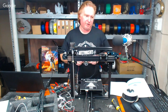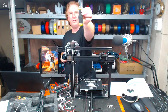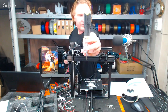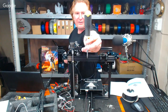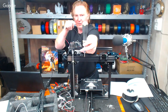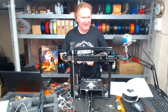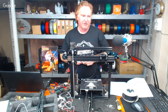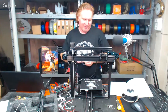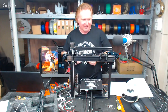Well, I understand the need for a purge block. Because if you're going to have a crisp color change, here's a better example. Let's say you're taking this handle and printing it like that on your build plate. To transfer from the yellow to the black, if you just had it do the transfer, you would have a certain amount of yellow mixed in with it, and then it would slowly transfer into the black. Unless a person was able to somehow have it do its purge in the infill portion. Now that might be a possibility too in the future, depending on the size of the item. But yeah, I understand why they have a purge block. It's just the amount of material that's wasted with it. That's the only questionable part that I have about it.